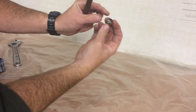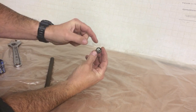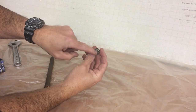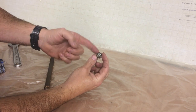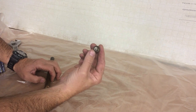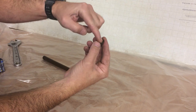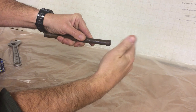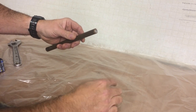The next thing you'll notice when you get the cap off is that the spring inside the cap will be loose — it'll come out. When refurbing these, I normally put a bit of solder in and push the spring back in, then cool it rapidly so the spring is soldered onto the cap. You probably won't do that if you're at home, so don't be scared of it — it's just a spring. Put the spring in before you put the cap back on, making sure it's touching the end of the batteries.